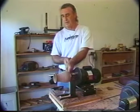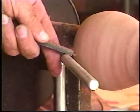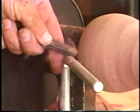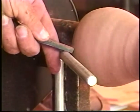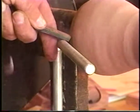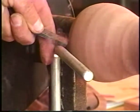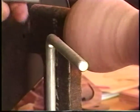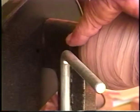and as it's shaping, you can increase pressure, but you don't want to dig in it too much. You can jam it into the piece. Just let the tool do the work. As you can see, it doesn't take long to shape the piece. And I don't want a real drastic cut. I think we'll find that this will be sufficient.